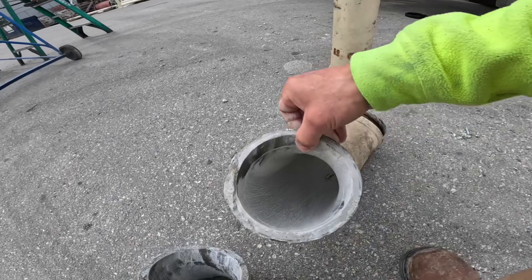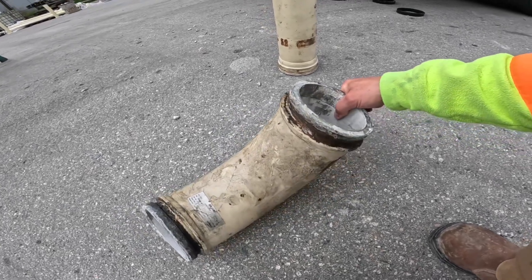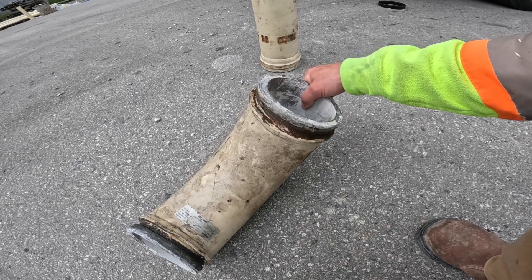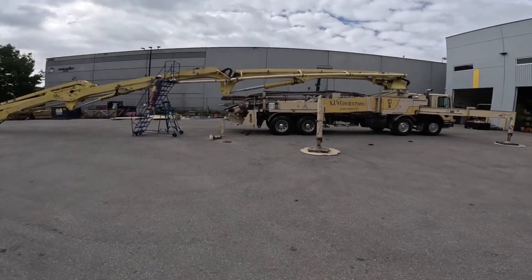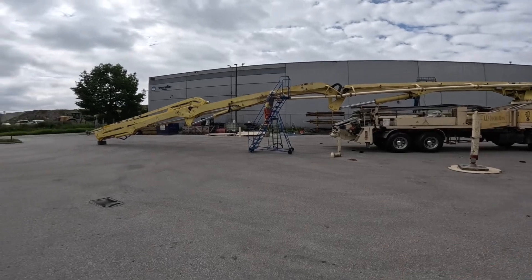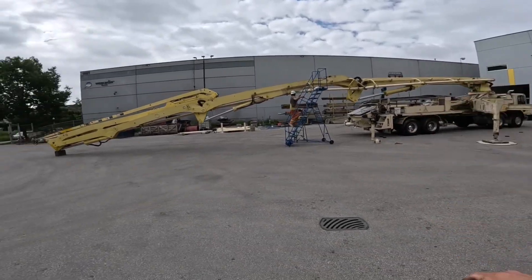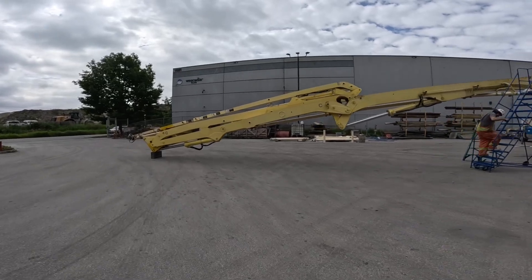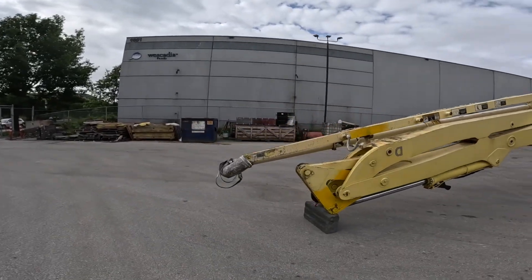Even this 90 is still heavy, heavy. So same as what we did with our pipe install video with Conforms and Mike Satner up here a couple months ago — we'll install all the pipe, leave the torque spec on the pipe hanger brackets loose, unfold the boom, fold it up a couple times so the pipes can settle into their happy spot, and then with the boom in the cradle we'll go back and torque those all to 27 foot-pounds. Dan and I had a contest to see who could torque it the closest without using a torque wrench — and I got Dan.